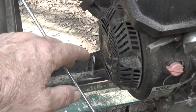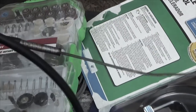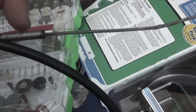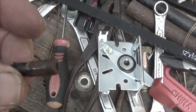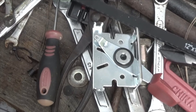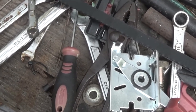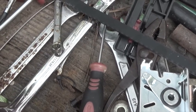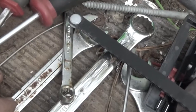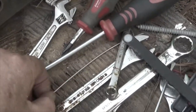Let me show you the cable I pulled off of it. I cut this end off — this is the end that has the screw that you adjust for tension. This is the back side of it, and that cap that was floating freely that you saw would fit down on top of this. This is the cap that I cut off, which slides onto the adjustment part. I didn't check the size of this new cable, but I had to drill out what I'll call a furl — they call it a cable attachment assembly — just a little bit for this cable to go through. I used what looks like a 3/32nd drill bit.